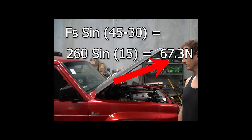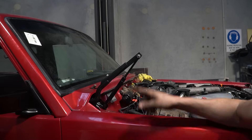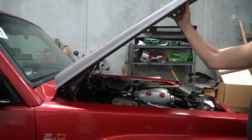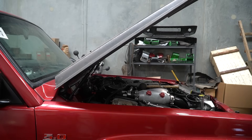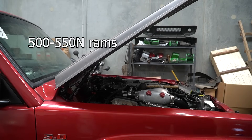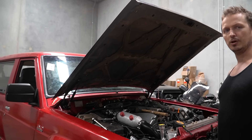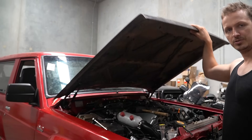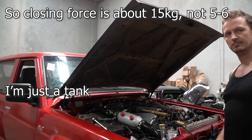Now in the previous video I said around 500 to 550 newtons of force would be a usable amount for these rams. These numbers look a little bit different, don't they? There are two rams, and that means the required force is basically halved to keep this just at the point where it's being held up. And obviously that's not ideal, because it means that if someone pushes on it, it'll close. So you have to add some security, which is why in the previous video I came up with a figure of about 500 to 550 newtons. Which means it would take a few kilos to close this. In the end, because of ram availability, I ended up going for a 600 newton ram. Which means I'm pulling here with probably about five or six kilos of force to close this. And there's no danger of it ever being closed by wind or anything like that.